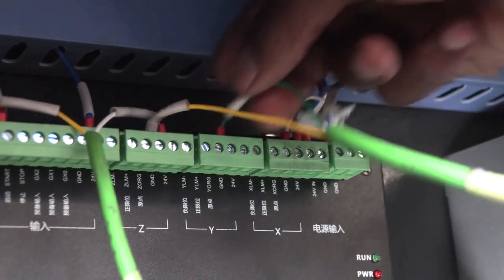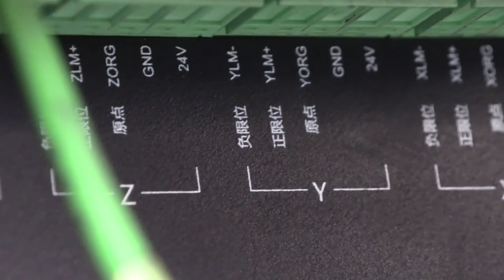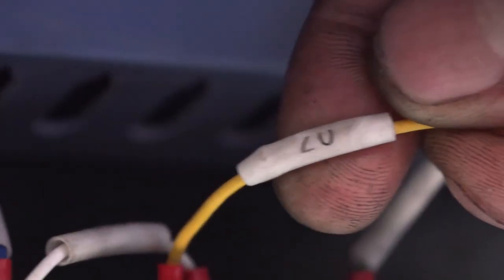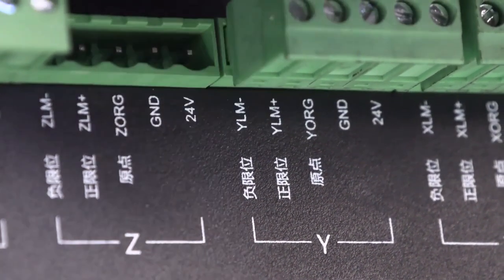Still on the first green cable, you also have a cable that says Y0. Look for the Y port on the motherboard where it says Y Origin, and put the Y0 cable onto that position and fit it in. You're going to do the same for the Z axis — get the cable that says Z0 and look for the port that says Z Origin. Align that connection by unscrewing it, putting the cable in, and then fitting your lug back in.